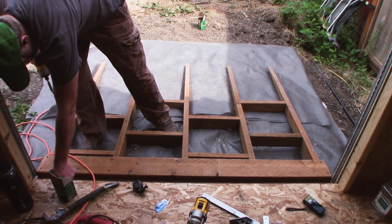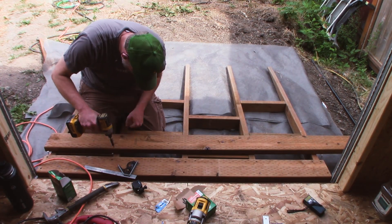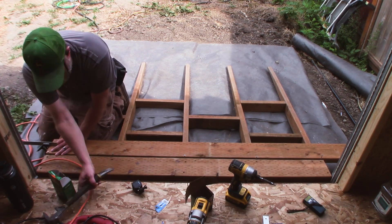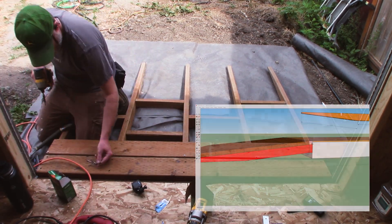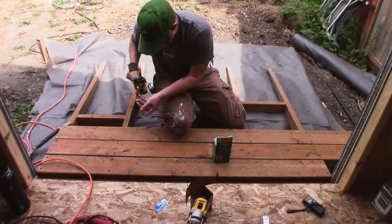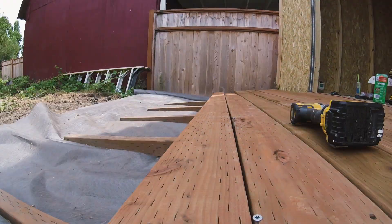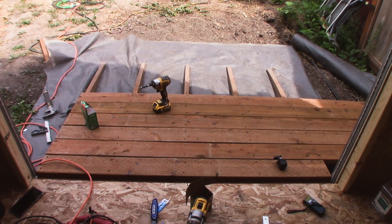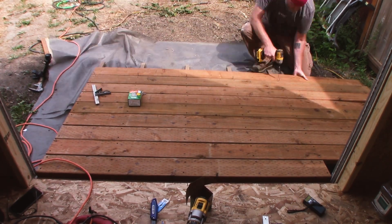The first piece of decking was cut to its final length because I wouldn't have had enough room to get the circular saw far enough to cut it off. The rest of the decking is left long, and then I go back after it's all attached and cut it all to length at once. You may notice there's a gap between the first piece of decking and the shed floor. Based on my drawing, I thought I'd have to cut a filler piece with an angle to make a nice transition, but it turned out that leaving it straight worked just fine — that angle didn't have to be cut in. In hindsight, I could have butted the first piece of decking right up against the shed floor.